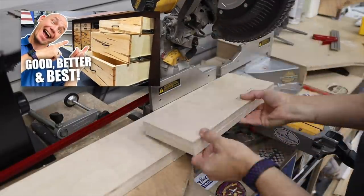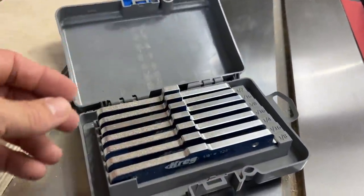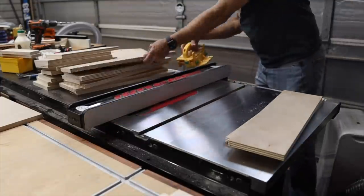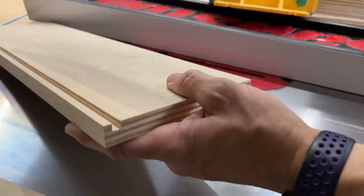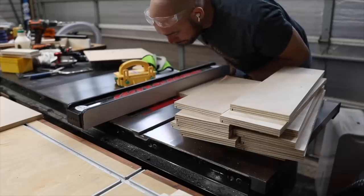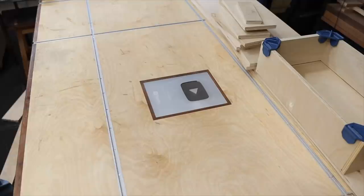If you haven't seen my drawer build video, I have a whole video linked in the description with a detailed process on how to build drawers. Once they're all cut to length I break out my Kreg setup blocks, move the blade up to a quarter inch, and set the fence also at a quarter inch. Then I start ripping dados using the table saw — a dado is just a groove in the plywood where the quarter-inch plywood bottom of the drawer will sit inside. I'll rip a quarter-inch groove, then move the fence over about a blade width and rip another groove to give me a quarter-inch dado.